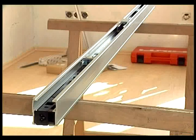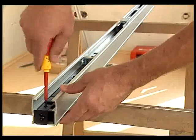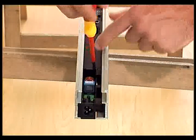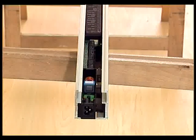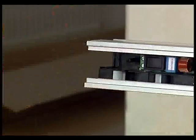Now unfasten the screw at the lid of the power supply housing. Then detach the lid. Please note that you will require the lid at a later point. Take the tip of a small screwdriver to open the lid of the control unit housing. When you have relaxed the respective screws at the connection terminals and at the protective earth, you can remove the power outlet.